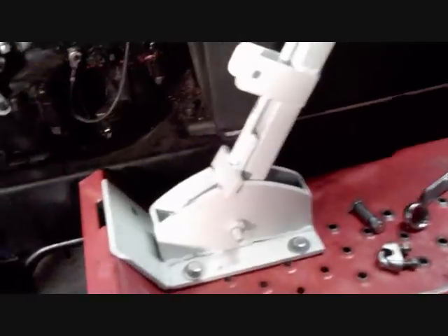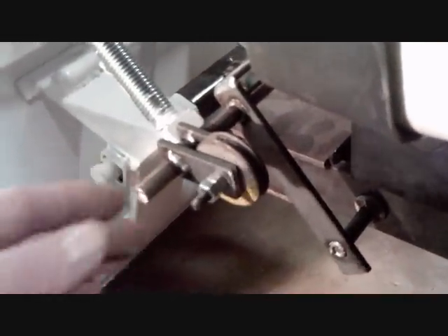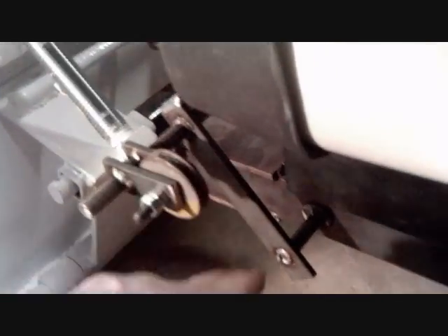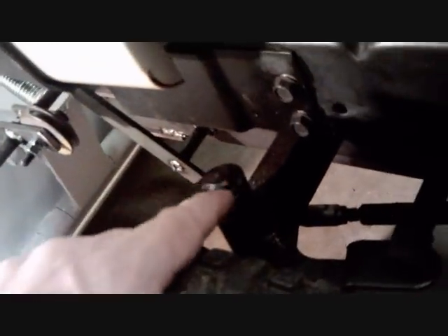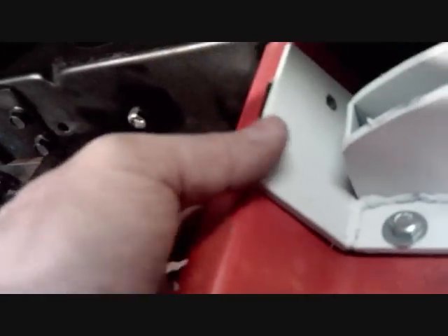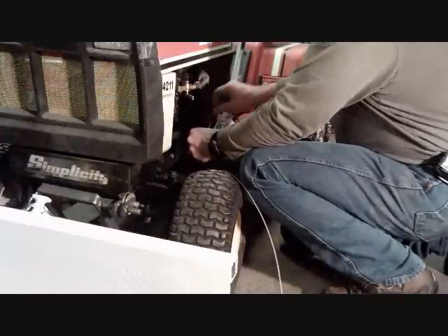And I'm going to go with a cable attachment. I've got my handle mounted on here. One end of the cable is going to go from here to here. And I mounted this on solid so that when the blade actually comes up, it will lower the cable so I don't have to modify the tractor at all on the fender, the body parts — I guess that's the hood — or the steering pin. And then the cable comes back to this extra plate I added on for support up against the toe kick here, where I'm going to run a piece of — yeah, wherever I put it in there. Hook this baby up and see if it's going to work out anything like I hope it would.